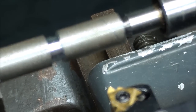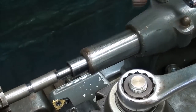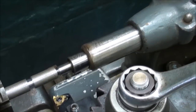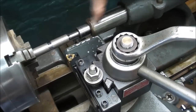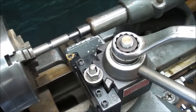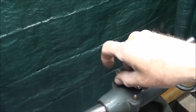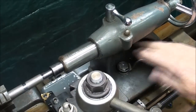In this case I have a little more of the quill sticking out of the tailstock than I would like, and that's necessary with this type of quick-change tool holder. Generally we like to minimize this. This is a spring-loaded center — watch it closely as I bring it in — and that supports the work and keeps it from flexing. Then tighten your quill lock. I've also tightened the tailstock lock.